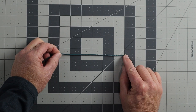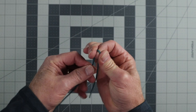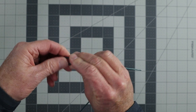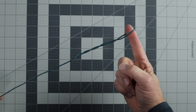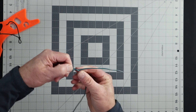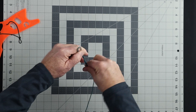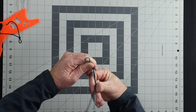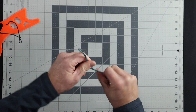Taking the other end of the dipole wires, measure back 5 inches from the end and fold it back on itself to create a small loop that we're going to use to guy the antenna. Make the loop about the size of your finger. Take the excess wire and wrap it around the main wire to keep the loop from coming apart while testing the antenna. Keep the wraps fairly loose so you can make adjustments more easily. Once the antenna is tuned, you can tighten up the wound ends and even tape it down if you want.